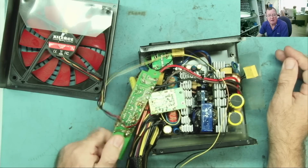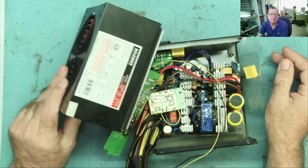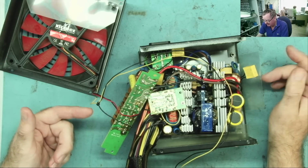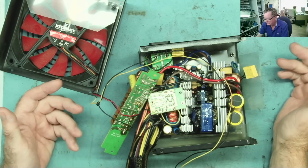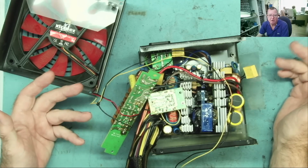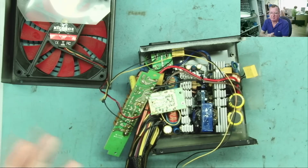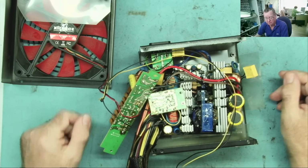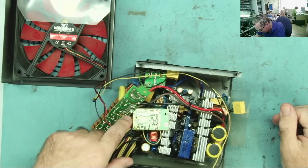So later that day I took a spare power supply, put it in the machine, and the machine's now working fine. So I tested the power supply, attached it to my ATX analyzer, and it doesn't do anything. It doesn't go bang anymore. It doesn't trip out the power. In fact, it didn't trip the power, it didn't even blow the fuse in the cable to the PC when it made the loud noise. So it appears just to be dead. No standby, no nothing.